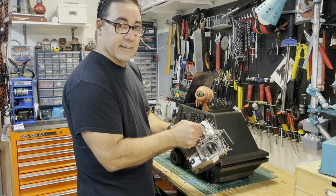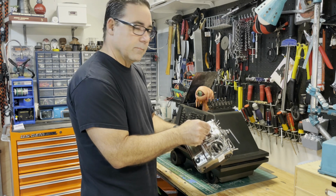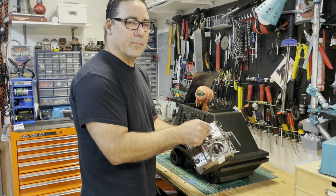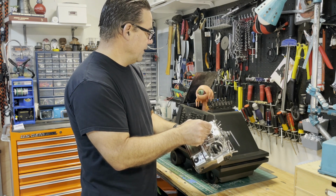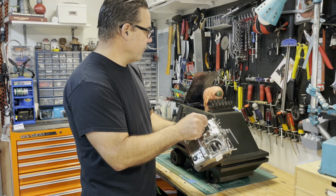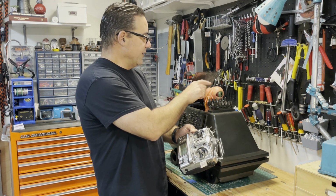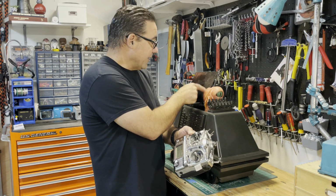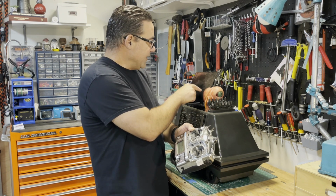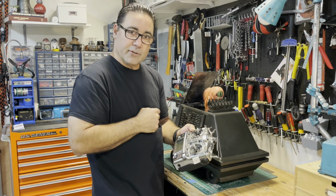and the eye and eyelid are going to be more of a random motion, although it's pre-programmed to do a specific routine. And so there are 4 servos inside of the head. One's right behind the eyeball, one is operating the blink mechanism. There's a servo here in the middle of the body that lifts the head up and down, and then there's a servo here towards the back of the body that turns the head left and right.